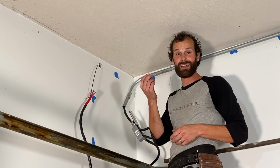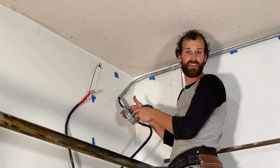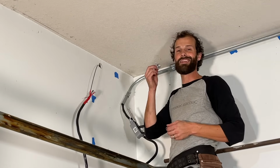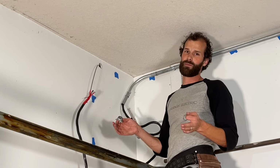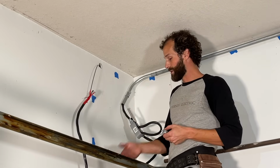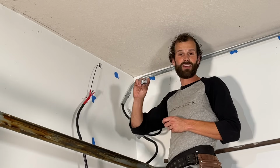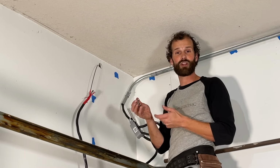But I wanted to highlight 2 things. One is make sure you have your sequence of parts in the correct order. And 2 is this pro tip. This is like the number 1 code violation in many panels across America, that people are feeding wire through the panel without a protective connector to both provide strain relief and protection against the sharp metal edge.